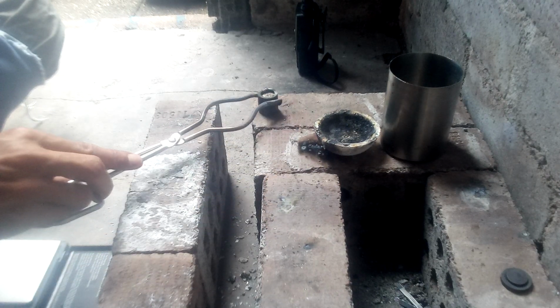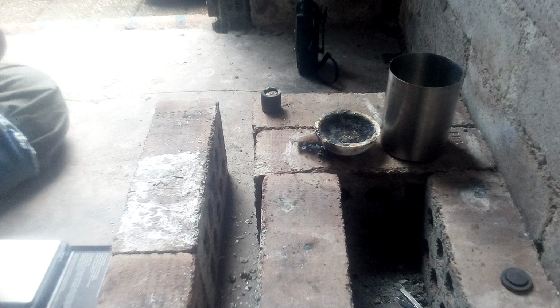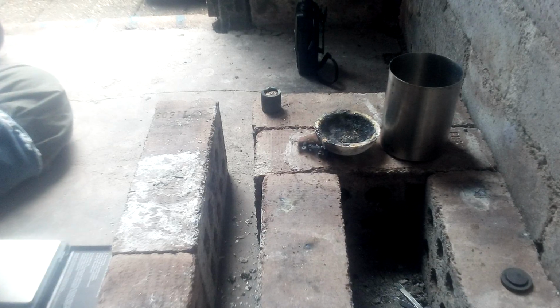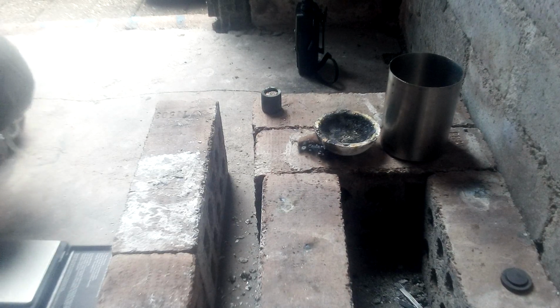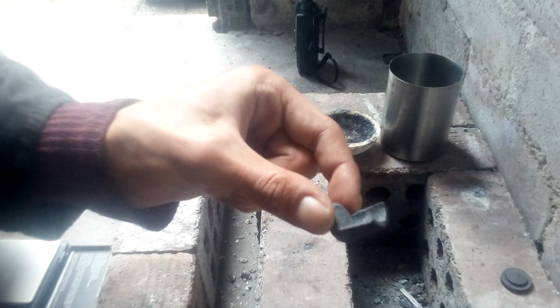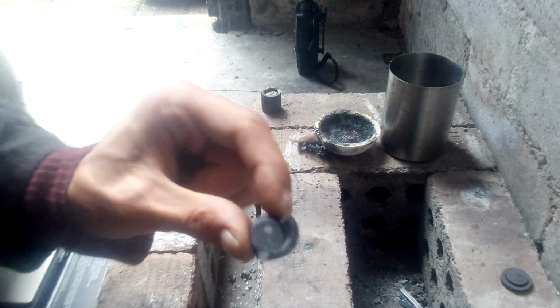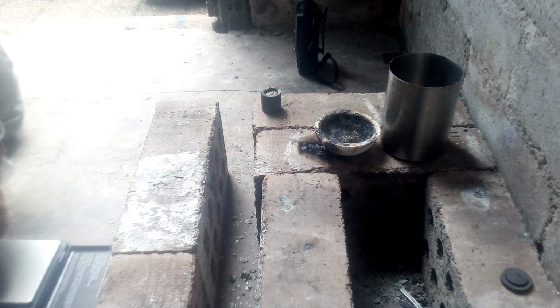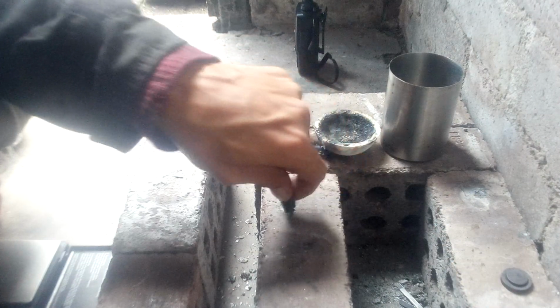That's cool. In the last minute there, make sure it's all cool, since indium has a habit of splatting, even though it looks cool. It isn't. And I can't pour water on the graphite mould, as it will start to dissolve the mould itself. This is the one I tried using first. As you can see, it is broken. I've used it many times for many other rounds, and it's reached the end of its life. Shattered on me from overuse. Suppose it could make for good chalk though, it is graphite.